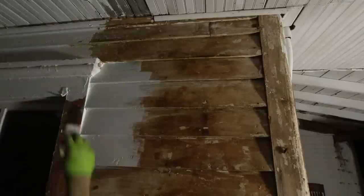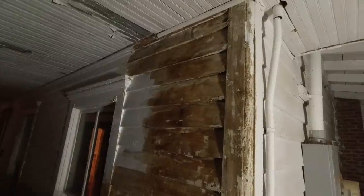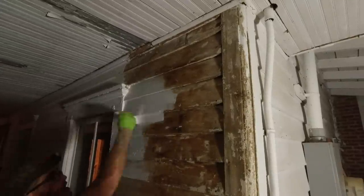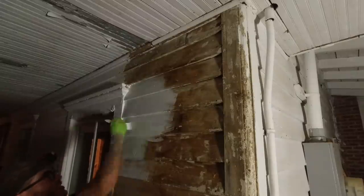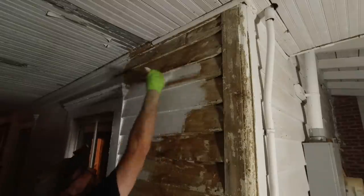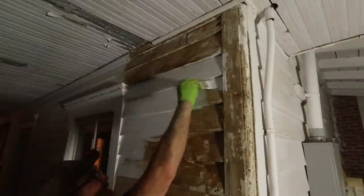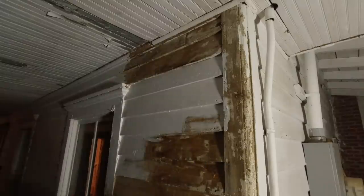You'll notice when we paint the porch poles, they were all painted with linseed oil. But I find it's difficult to use linseed oil on a flat wall because it's just so runny. We bought white linseed oil paint — the plan was to use linseed oil everywhere as restoration advocates recommend. But this is under a covered porch, and this paint is creamy, it fills cracks. The house is old and it's never going to be perfect, but the cracks and crevices all eventually get filled.